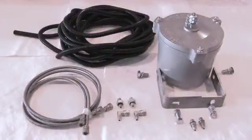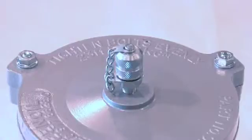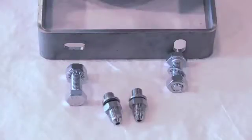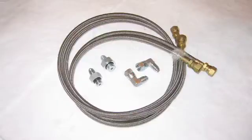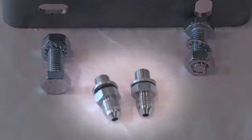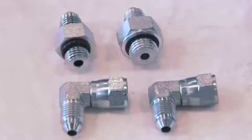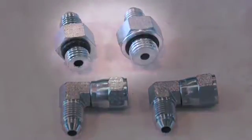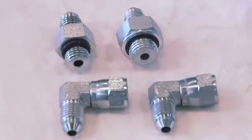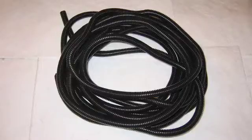The parts needed for the Clean Oil Kit include the Clean Oil Bowl, the sample port, mounting bracket and bolts, two braided hoses for pressure and return, two fittings for the bottom of the bowl — one for pressure in and the other for return — two fittings for the pressure in and return on the engine, two 90 degree fittings for one end of each hose, wire loom, and plastic wrap to protect the hoses.